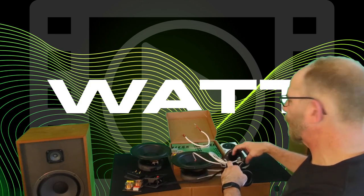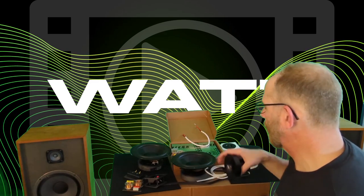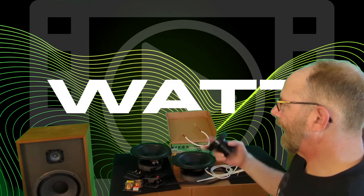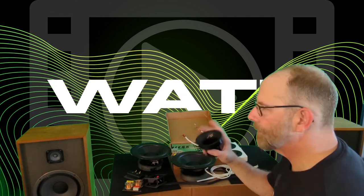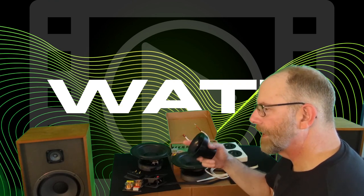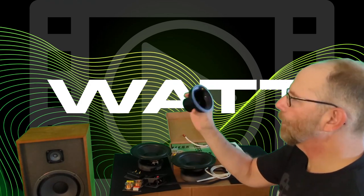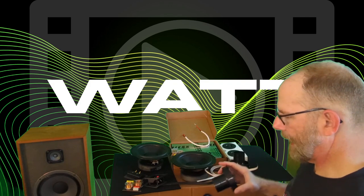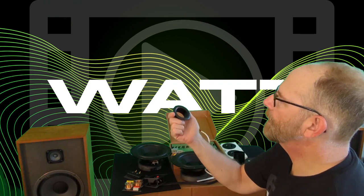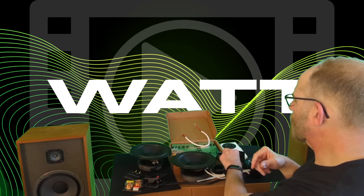Just in case, I pulled out some bass reflex ports. I'm going to run the math a couple of different ways — I'll look at Parts Express's recommendations for boxes for these woofers, and I'll measure the cabinets to confirm the internal volume. I'd like to stick with a sealed design, but if the woofer works better ported, I've got options: a two-inch precision flared port kit, and a couple of one and three-quarter inch by one-inch ports salvaged from an older Jensen speaker.